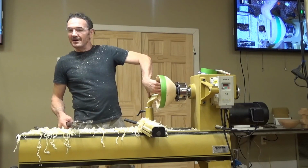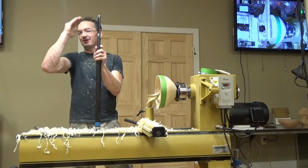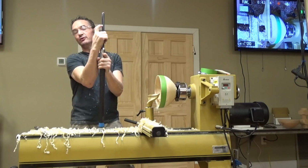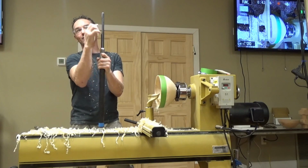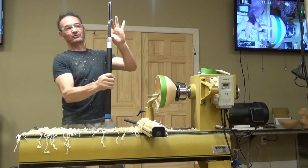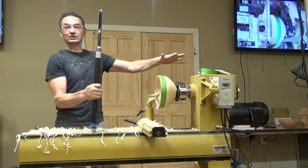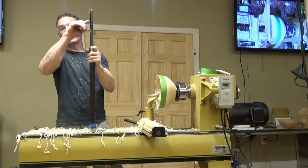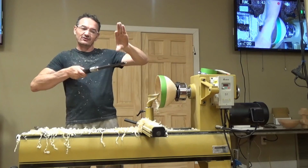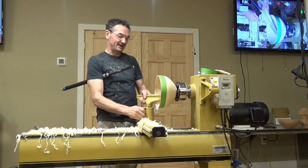No, manufacturer error. Made the flute too long on this tool and it vibrates just a little bit. So Ashley Harwood, my apprentice, she had hers made with the flute an inch shorter and it doesn't vibrate. Doug Thompson made the flute a little bit longer, thinking he's giving you a better bargain. But when this tool gets down to that short, I'm not using it. It's already too short for a bottom bowl gouge, it won't reach. But he milled the flute just that extra inch. And it's quite thin, the steel here, because the bottom bowl gouge has got quite a bit of material removed from it. So it's got a little bit of deflection. So you're just listening, and you might say, oh, angle the tool rest in. It doesn't help.